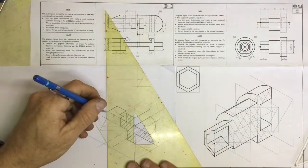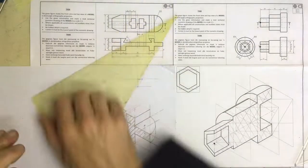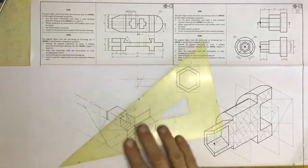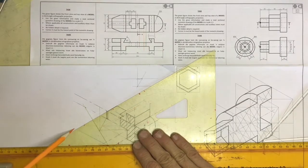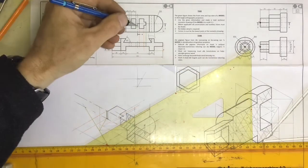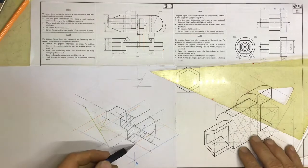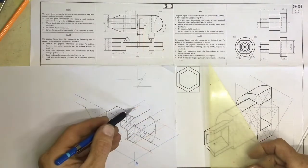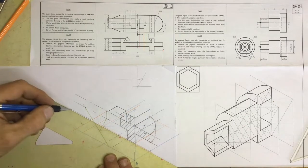That is the end of my sectional view, so I can draw a little line in at that point, okay? And I can draw in that little line over there, that little line over there. And from that point, I need to start drawing this line coming across over here. All right, so I've got a construction line that I'm going to draw out over here, and a construction line that I'm going to draw out over there. And I can then measure off whatever that distance is, which I have already because of the little construction line square that I drew at the top over here.